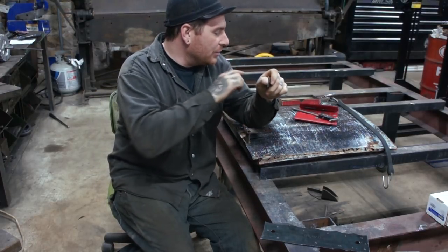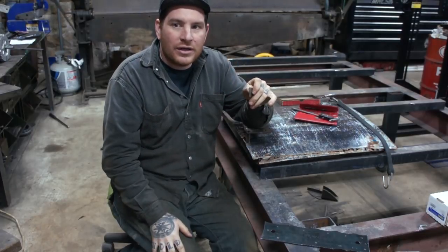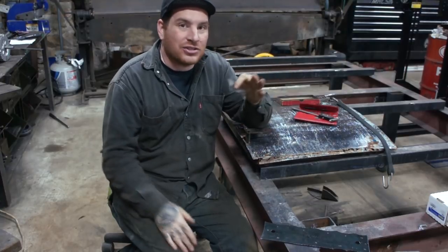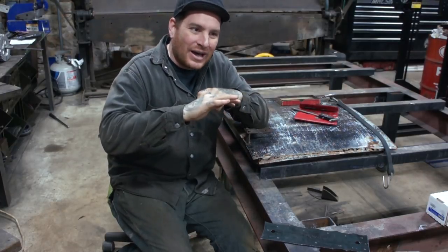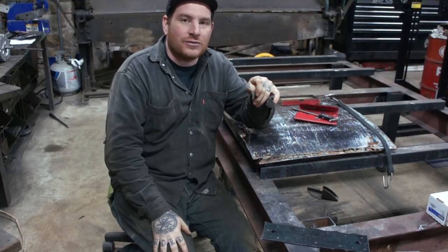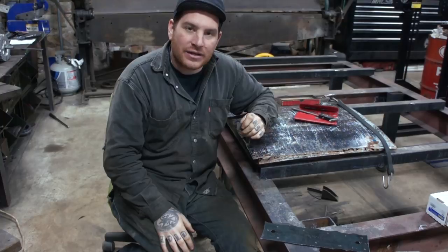So we're going to cut with the lathe to get the depths and everything correct, and then we can blend it in with a sander or sandpaper to get it to roll how we want. I will try and blend it the best I can by hand with the lathe, but as I mentioned in other videos, I'm kind of a beginner with machining, so sometimes I will take shortcuts like this by sanding something to get a compound radius to match what I need. But get the measurements down, we're going to throw this piece that I've chucked up in the lathe in, and start cutting into it, and hopefully we should have a die made up relatively quickly.